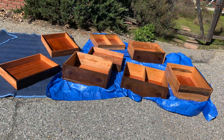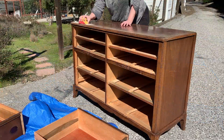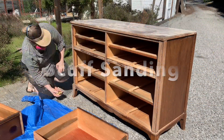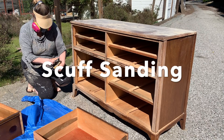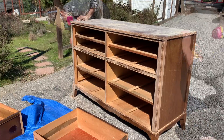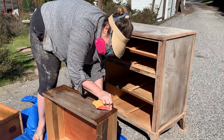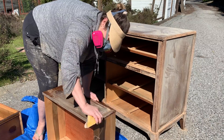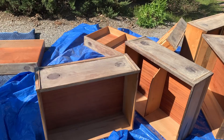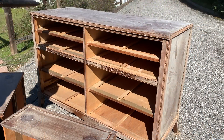There's nothing like a sun bath to kick out any old smells. Next I gave it a good scuff sanding with 220 grit sandpaper. I saw immediately how easily that old finish was coming off and I knew I would need to prime this piece well. Quick tip: always wear a dust mask when you are sanding and leave it on while you're cleaning up the dust.